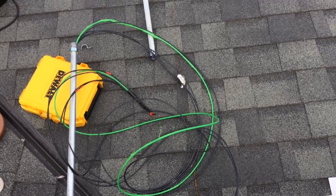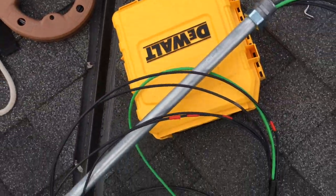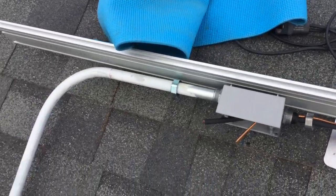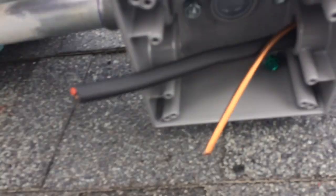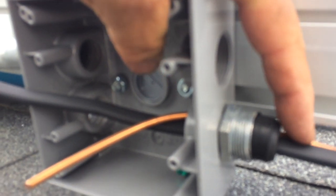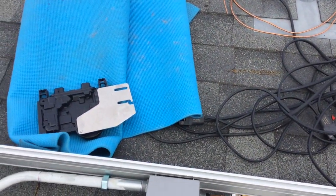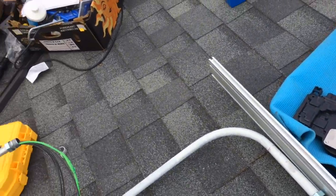My idea is I've actually pulled a few extra cables. Right now I only need line one, line two, and green. I've actually got two other cables as well, which I mentioned before. What I'm doing here is I've got a regular two-gang box, which I think is good because I've got a high amount of wires. You can see I've just got some washers from the hardware store and I drilled holes, so this thing moves around, which is nice. Over here I found a Romex-type connector where I can run the Enphase cable. I'm basically just going to cut this Enphase cable down — there's a tail on it that they give you.